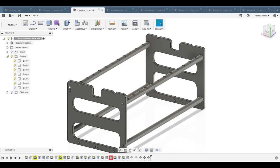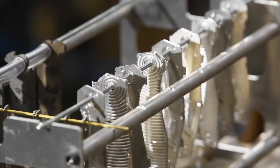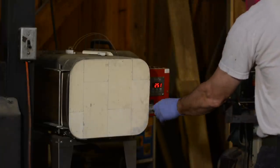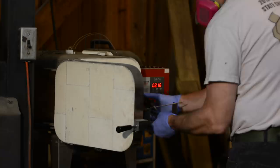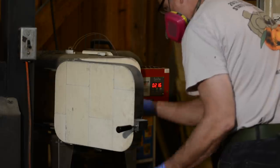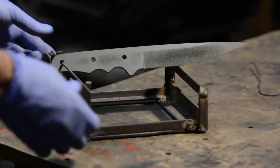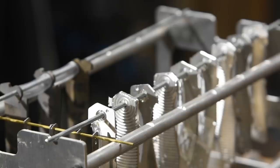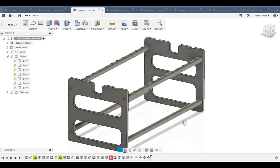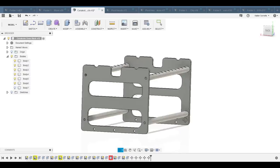I wanted the handles built into the frame so it's easy to load and unload. One really crucial thing is that the parts can't bang together when you load them — if they do, they'll stick to each other or mess up the finish and you have to start all over. So I wanted to be able to rack things up in a bunch of different ways so there's no danger of ruining the parts. Typically, I hang parts on lengths of thin metal rod, and I can run them down the length of the rack or side to side. I also wanted to be able to load in little trays and painting fixtures for finishing screw heads, pivots, and other small parts.